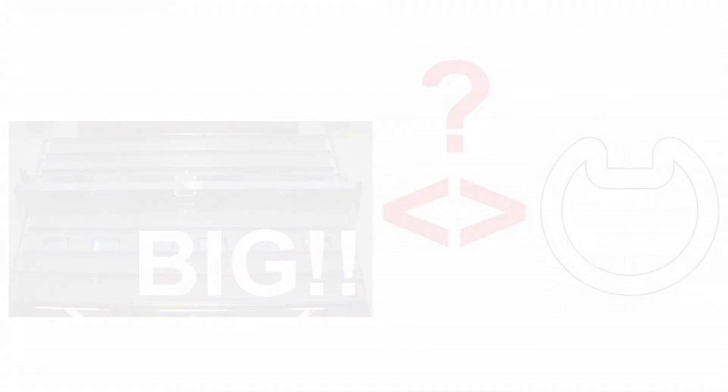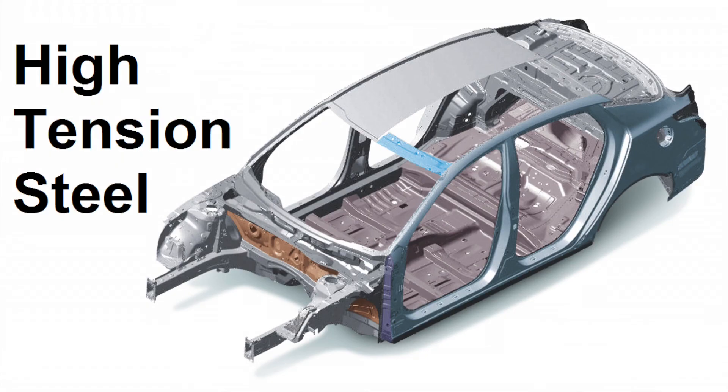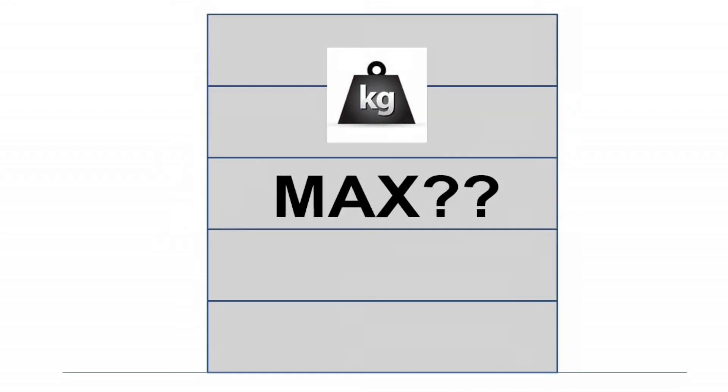But it works, and the price advantage is big. How is it possible that the tube is strong enough? The tube is made out of four-millimeter high-tension steel — the material being used in the automotive industry — because it combines low weight with strength. Apart from the lower price, the low handling weight is also an advantage.